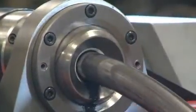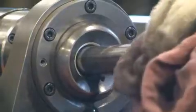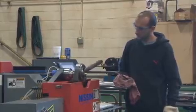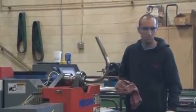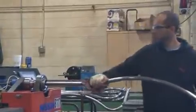For example, this is a three-quarter inch tube. As long as we have three times the diameter radius on this part — in this case two and a quarter — as long as it's that radius or larger, we're able to bend this part on this bender without any straights between the bends that you need in conventional or rotary bending. We're able to go from one radius right into another one without any straights.